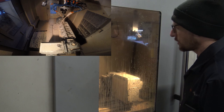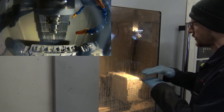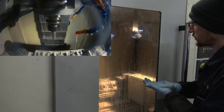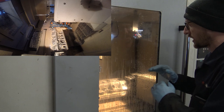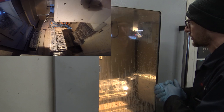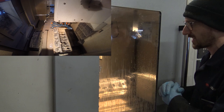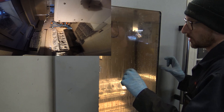Next, the machine comes down and takes the Z reference off of the base of the jig. There's a little machined face there which is at the same plane as the face of the cylinder head, so that's our zero from the face of the cylinder head. Next it's going to come in and machine the rocker pedestal bases. It knows what height they should be from the face reference, accounting for what we've actually got to remove off the head in our final skim. Sometimes there isn't quite enough casting - it's shrunk back in the casting sand - so at the end I check these and sometimes have to take an extra five or ten thou off, most commonly on the very outer positions where we put the rocker shaft support brackets.